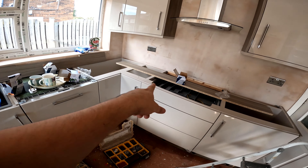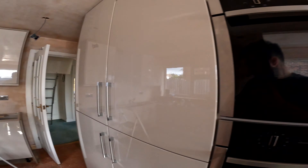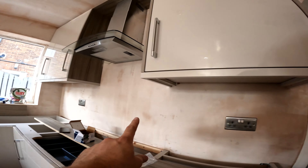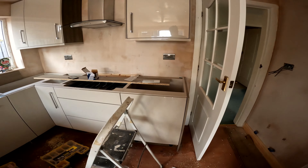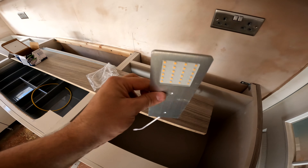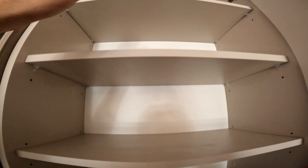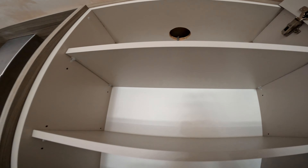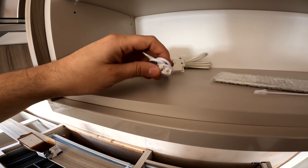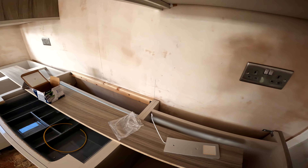After that we've got wiring for the hob — we can't do that till the worktops are in. The next little job is the under cabs. We've marked out already — you can see the pencil line. We've got under cab going under here, under there, and there. The COB lights come like this — it's just two screws. A little extended piece goes up the back. The kitchen fitter has left a little cut-out there — it's like a little desk tidy, so it'll pop in and you won't see a hole. The cable just plugs into this, fits down the back, and plugs into the light. That's how it powers up.